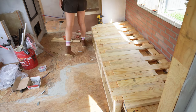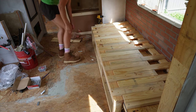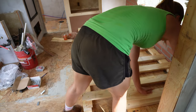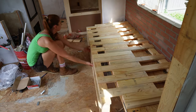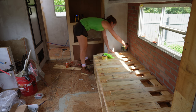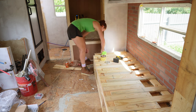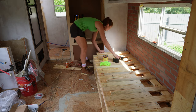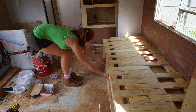As you can see, it gets almost stuck at one point — it slides out fine but it's still not as smooth as I'd like. I think part of that is because the front frame is made of two by fours instead of inch and a half like I did last time. I'm adjusting the side rails to make it either tighter or looser — if it wobbles too much side to side, you move that board in; if it's too tight, you move it out a little bit. The last step for this part: I put some wax on it — on the outer piece that slides on the pine and on the inside of that two by four that slides along the rectangle frame — and after that it slides out pretty smoothly.